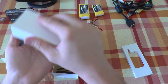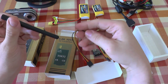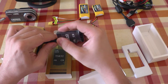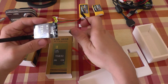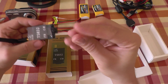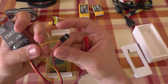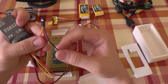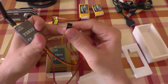In the transmitter box we have its antenna and also the cable. It's a simple antenna like on wireless routers — omnidirectional. This is a video and also power cable. It takes power through this connector, the yellow wire is the video signal, the black wire is common ground for video signal and power, and the red wire is for supplying power to your camera.